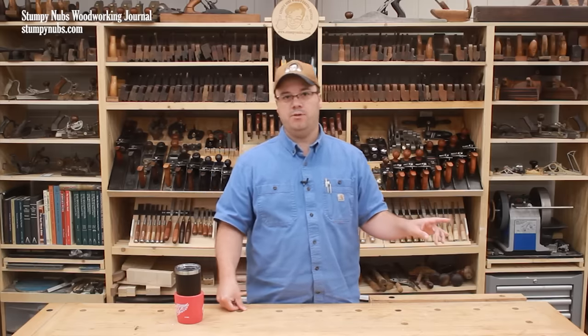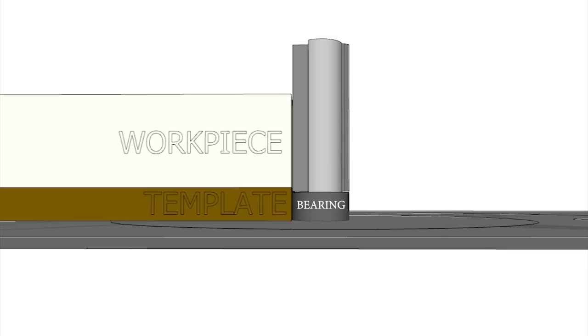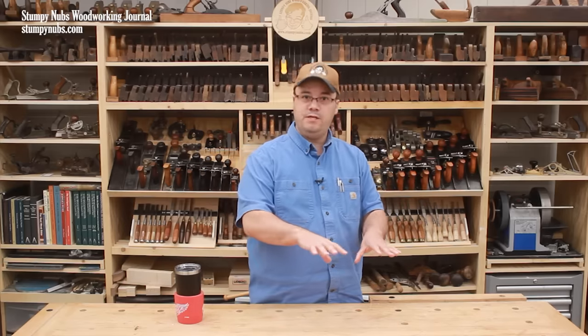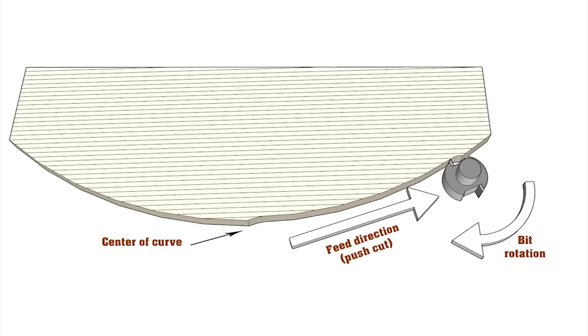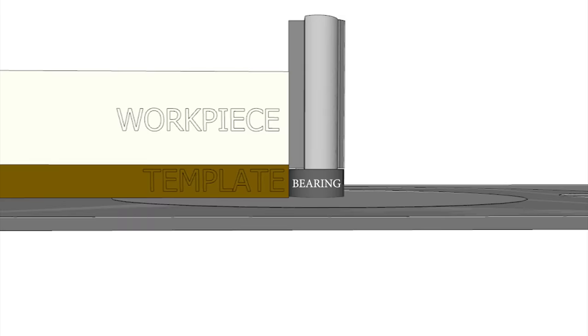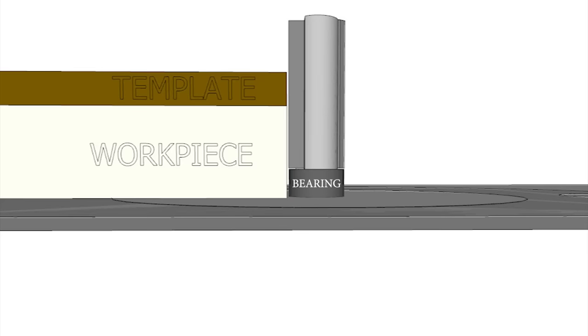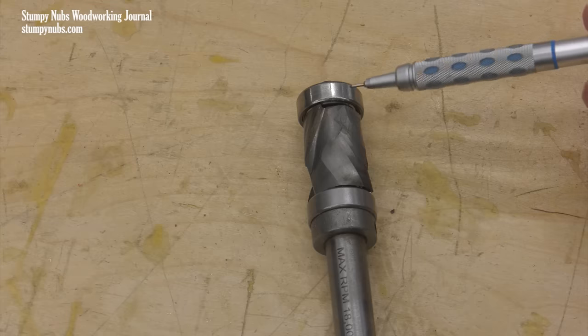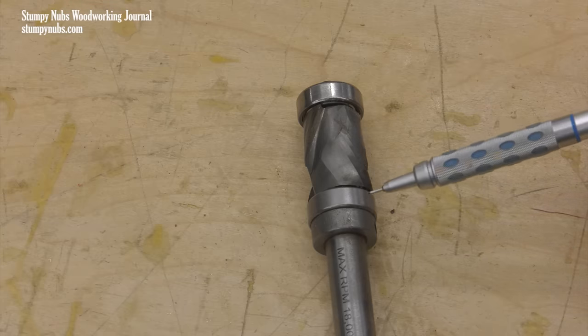You have a similar choice to make at the router table. Here the overall cutting length of a template bit is immaterial because the excess can simply protrude into the air above the workpiece. But as you work your way around a template, at some point you may find yourself cutting against the grain. You cannot reverse your feed direction to get a cleaner cut at the router table because this will produce a dangerous climb cut. We have a tutorial about grain direction and router climb cuts linked below. To avoid cutting against the grain, you would have to flip the workpiece — now the template's on top, so you must also switch to a flush trim bit with the bearing on the end. If swapping router bits mid-cut sounds like a pain, they do make some bits with bearings on both ends of the cutter — sort of a flush trim template bit hybrid.